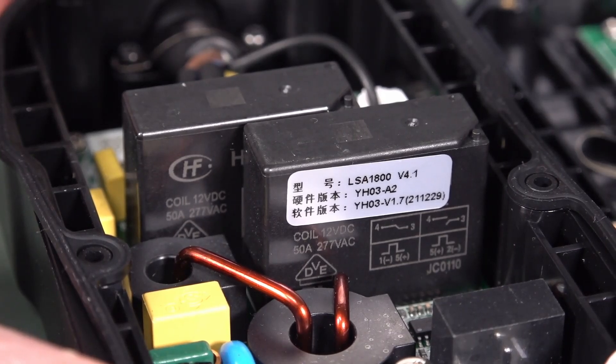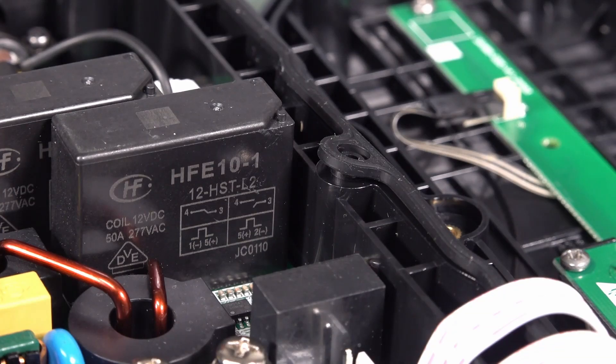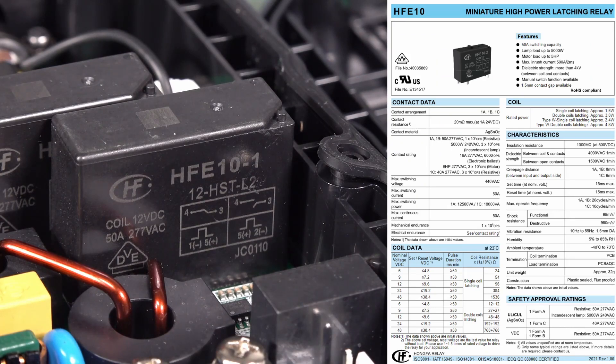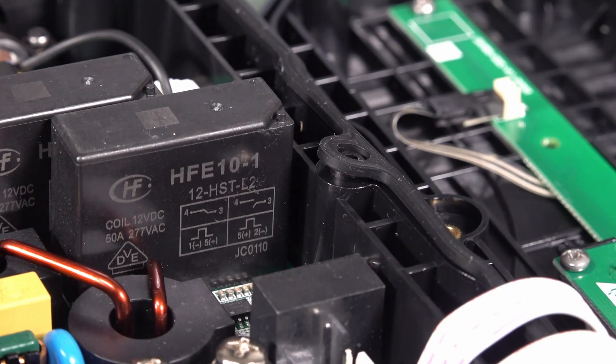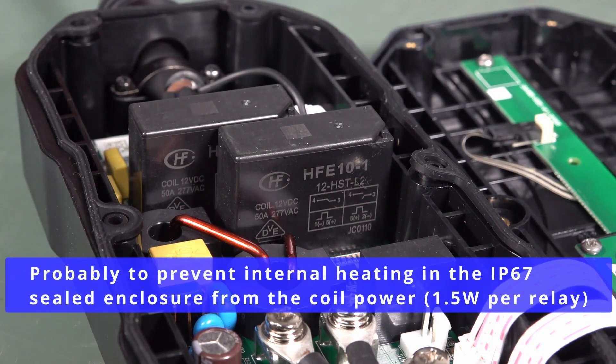A bunch of series resistors up there — they're putting those in series to get a high voltage resistor to get the voltage drop. As for the relays, the big question is: are these Japanese relays? Not Japanese relays unfortunately. These are Hongfa brand, but they are serious relays for this sort of application and also certified. So these are actually 50-amp relays — they might actually use this same board in the 32-amp version as well. And these are actually latching relays, so they don't need coil power to keep them in the latched state. But I don't know why you'd use a latching relay for this — I would prefer that if it lost power, it should be normally open and require active electronics to keep it energized and switched on.